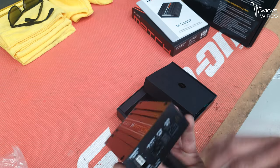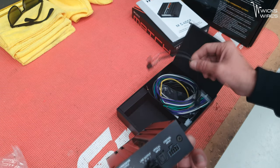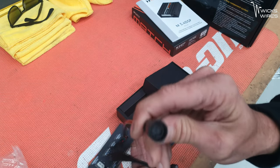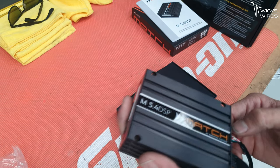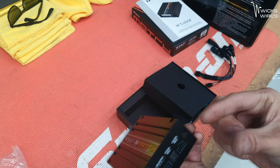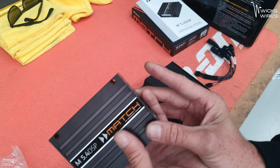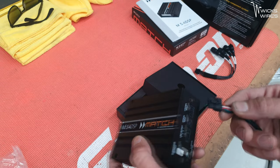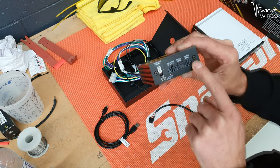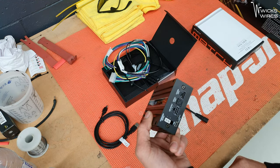So we're actually looking at nine channels of DSP. The other cool thing is this has got the new control port, which is the newest updated version. If you still want to use one of the older style, there is an adapter that comes in the box, so you can plug in and adapt back to that old style plug for the directors, etc. But there are new cables coming for all of those with the direct control port. The big win is that it is so much shorter now — with the old port the cable would hang out quite far, which made tight installations difficult. And the bonus is that this will now do power as well, so unlike the old director cables where you had to separately power them, it will all get powered through that one port.